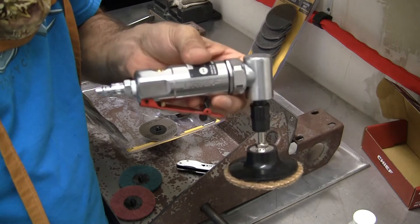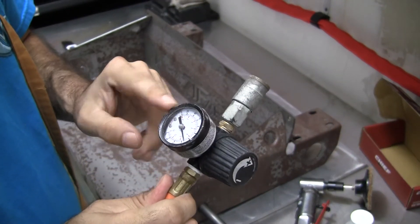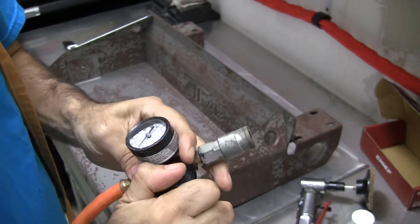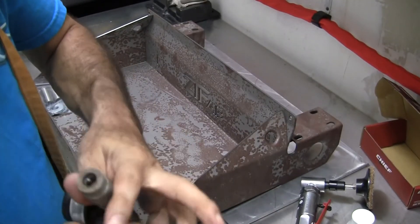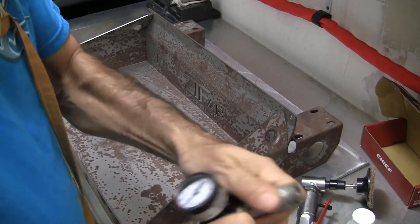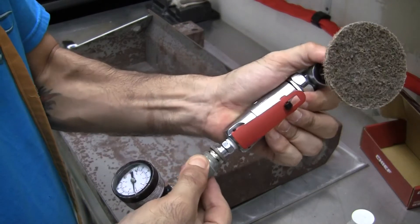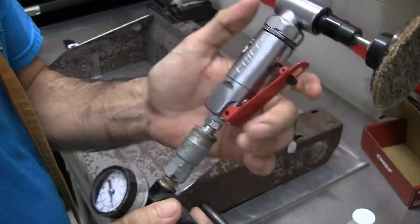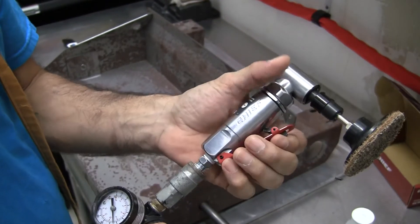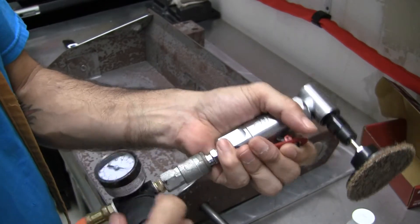The Chief quarter-inch angle grinder — let me get some air hooked up and see how well this works. At the end of my hose I have a pressure gauge showing 120 PSI. You don't want more than 90 pounds coming out of this — that's all that's recommended. So let me get that adjusted.